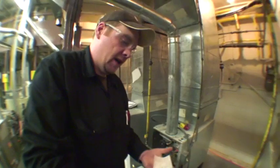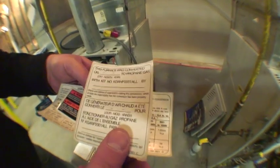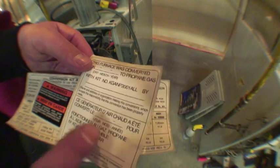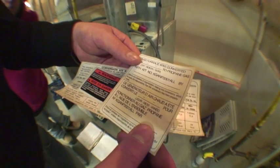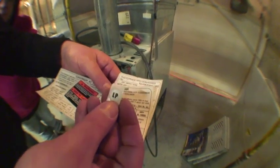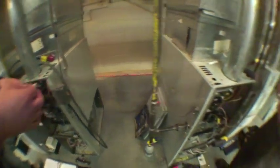When you purchase a propane conversion kit, in the kit you're going to get certain stickers. This one here is to be placed onto the furnace after completion — stating this furnace was converted to propane gas, giving the date, kit number, and your name and address of the organization making the conversion, which primarily gives the installer the responsibility that it's been properly done. Also, we have a little LP sticker — standing for liquid propane — which will be placed onto the gas valve.